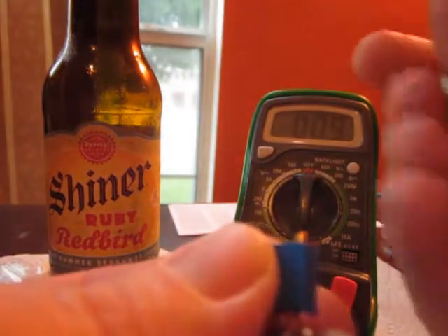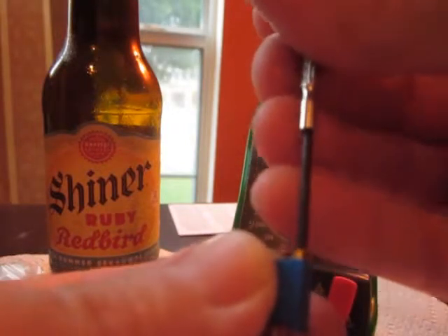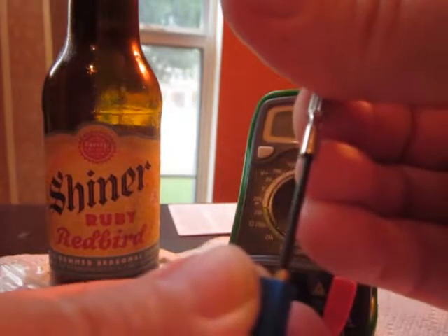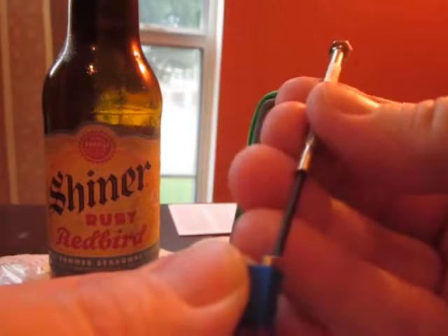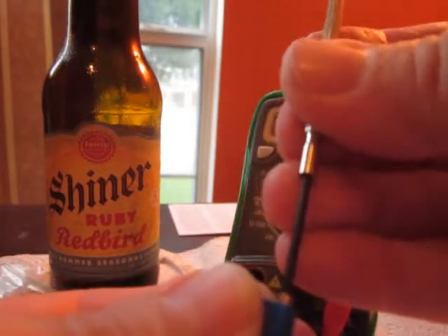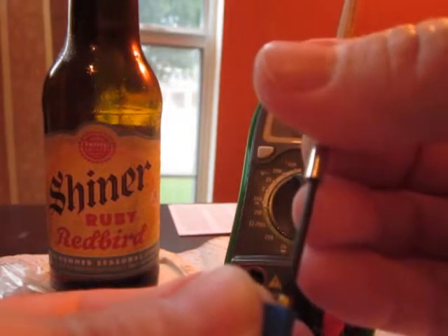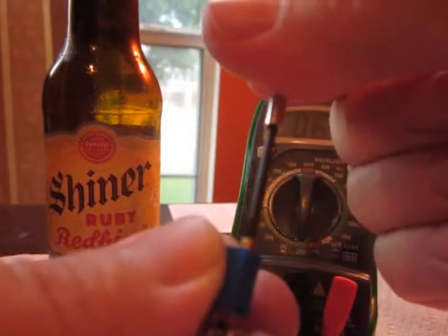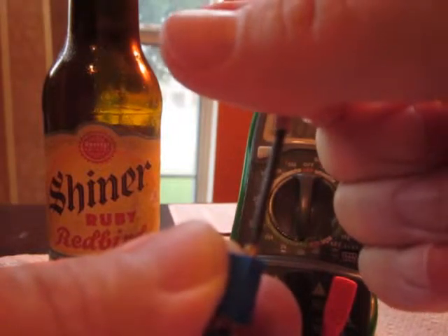Watch the screen on this one. I'm going to turn it — it's basically at one. Look how much I'm turning this — I'm at three. The adjustability that you can get on this is just tremendous. I'm turning it another full revolution — I'm at six. Basically, you can have total control over this adjustable resistor trim pot to properly adjust your bias.